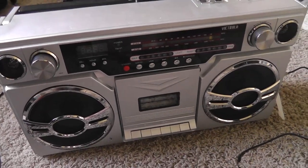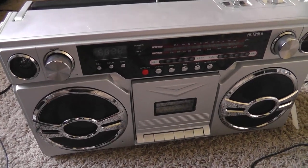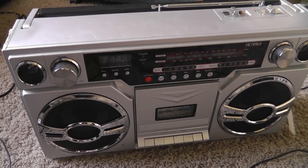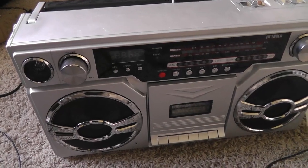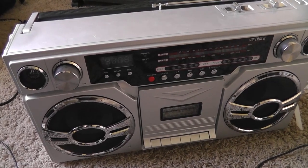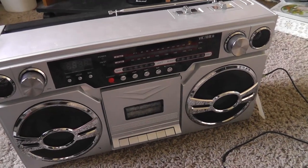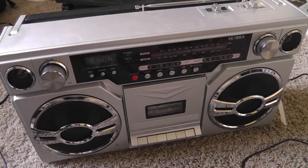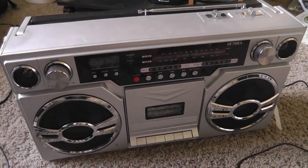So I just proved that it actually is possible to adjust the speed of a boombox. You just have to open it up, find the motor — which is a little round cylinder — and adjust that screw, and you will be able to adjust the speed of your boombox. And that should be the case with any boombox, not just this one. Thank you guys for watching — hope this video helped you out. Feel free to like, comment, and subscribe. Tell me what you guys think, and I will see you next time. Be safe.